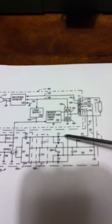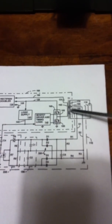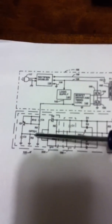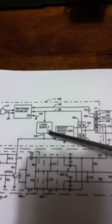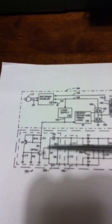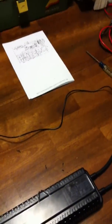Here's the solution. This entire circuit here is the safety circuit. It has a coil that is part of the output coil, and it detects an overvoltage, overcurrent, or ground fault condition and sends a signal through this opto-isolator, which turns on this transistor, which turns off the logic circuit and the power supply, disabling the output. My solution was simply to put a switch across the input of this opto-isolator, which disables it and allows the output to continue even when you have a ground situation.